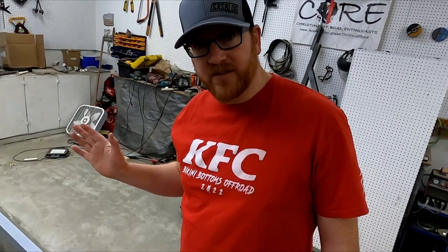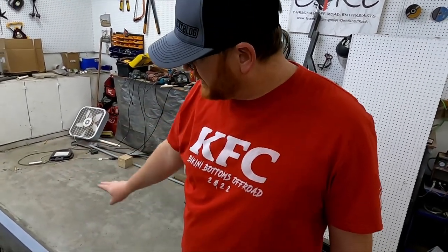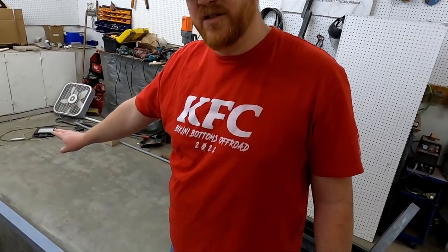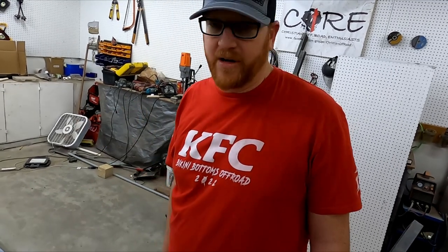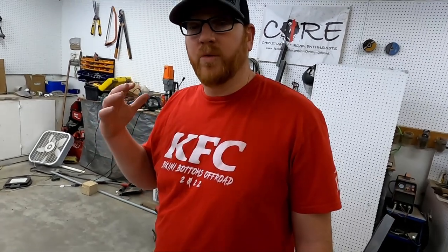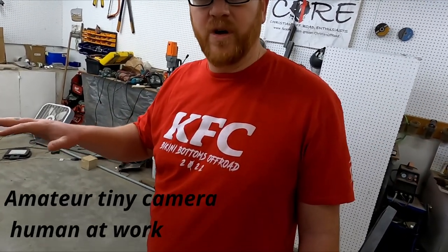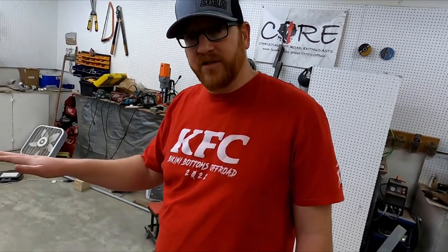One side is about dead level, the side to side is level, and one side has about a 1/16-inch of a change on the level. Not quite sure how that all adds up, but I think it's gonna be really excellent, and we probably need to make sure when we bring our floor plates up here that we have a way to do some shimming so that it'll look completely flush when it's at the top.